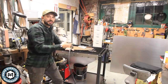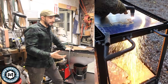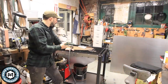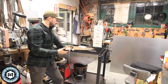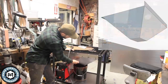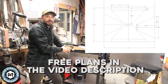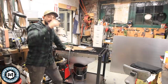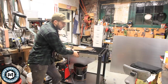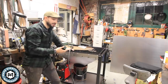The table is great, but when you're cutting, sparks shoot straight through the bottom, which can be problematic in a shop like mine where there's flammable stuff everywhere. I like to plasma cut outside, but even there you've got leaves and things that can catch on fire. So I went into SketchUp and designed this triangular collector made out of basically half a sheet of 20 gauge sheet metal. I'll put plans in the description with dimensions to build it to fit this table.